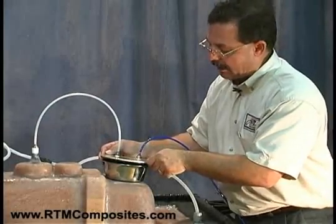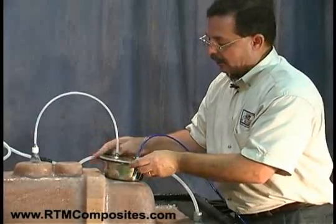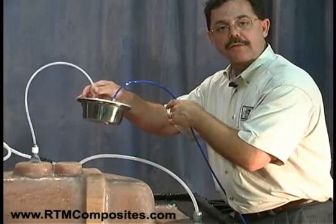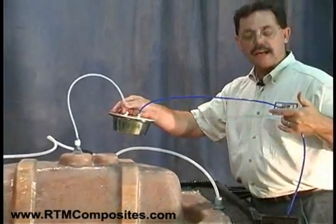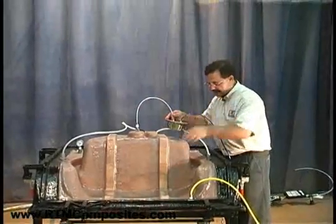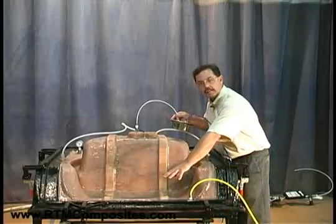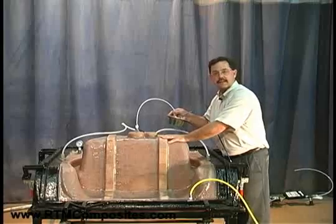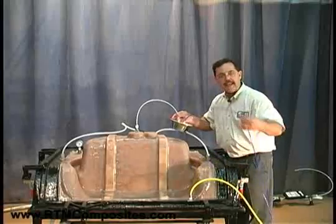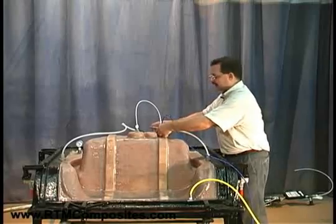Now we're going to bring the catch pot assembly together, because this lid has an elastomer seal sealing on the flange. We'll bring them together and start the vacuum — that's obviously vacuum locked together. This blue line is at a half a bar, so this entire cavity area — with the dynamic resin channel seal sealing off the high vacuum in this area, and the wing seal sealing off from atmosphere — forms one vacuum environment. The second vacuum environment is in the cavity itself. It sounds confusing, but it's very simple: you simply have a full vacuum line and a regulated vacuum line, and that's all the connections needed.